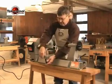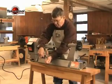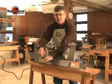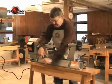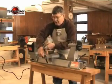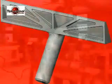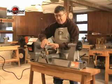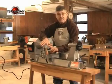The next improvement is soft grip handles. They're much more comfortable than the old ones. On my original DVR, I turned wood handles to go over the metal ones, and they improved the comfort a lot — and these are even better. You can lean on them. Finally, we have a new tool rest, which is a heavy cast iron tool rest with the correct shape to give you minimum fulcrum distance. Whether you are spindle turning, faceplate turning, or scraping, you have minimum fulcrum distance, and this is a great improvement.